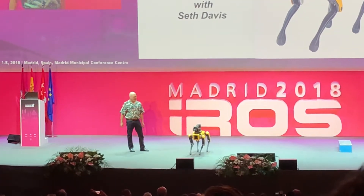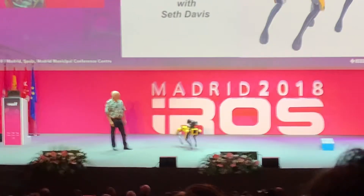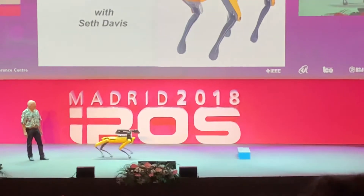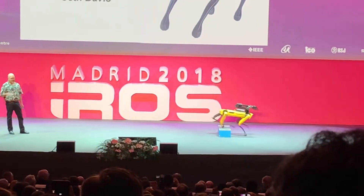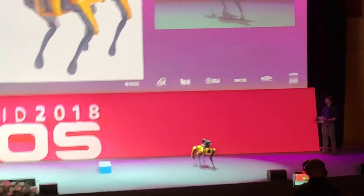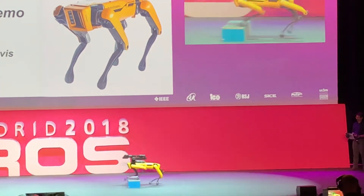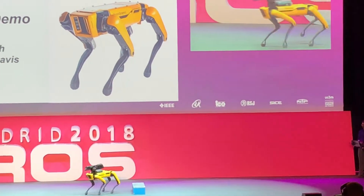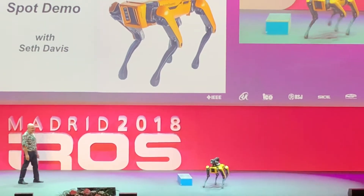Using this vision system, the robot can deal with some terrain. Seth is going to walk over that block there. You can see the robot can tell that it's approaching it, and this is using the kind of quadratic programming receding horizon control that we talked about before. One of the things the robot can do is handle it sideways because it's got cameras on the sides.